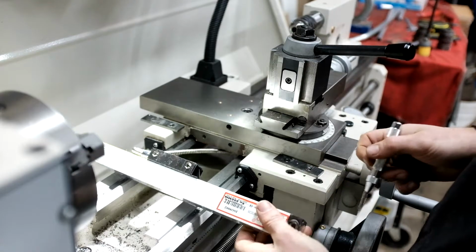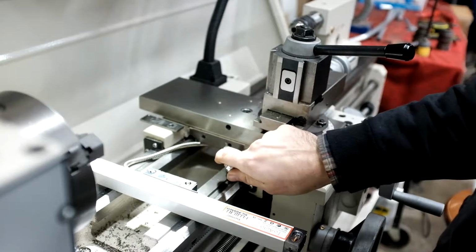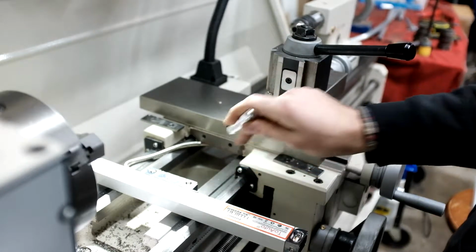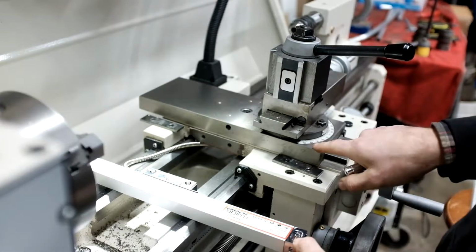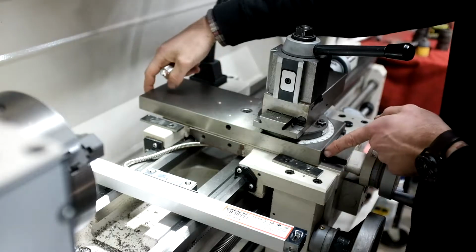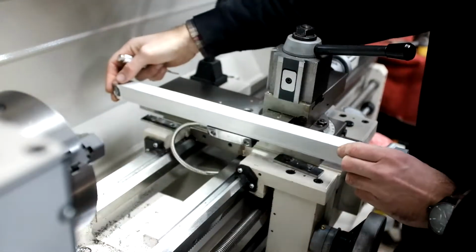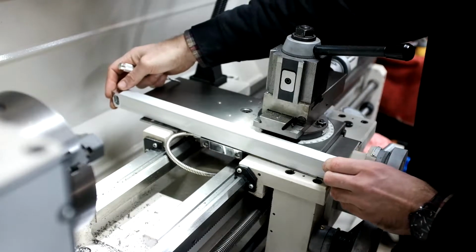There'll be space there. The encoder is gonna be mounted on this part of the carriage, so it'll be affixed, and the rail itself will be mounted to the slide with little right angle tabs coming out to make up for the extra length.